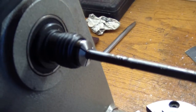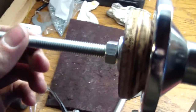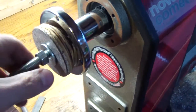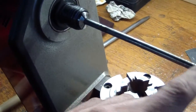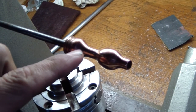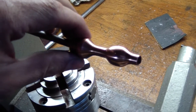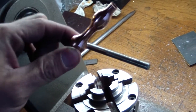What I changed here is that I got a hold of some arbors. That arbor is made for a quarter-inch rod, which is what's sticking out of this right now. It's designed for a draw bar — I just took a piece of three-eighths all-thread and stuck it through, then I have a block of wood and a nut which tightens and draws the arbor in. I'm doing that because I want to have a piece of copper tubing spun down against the rod so I can get that quarter-inch inside diameter — nice and smooth — so I can easily take a piece of quarter-inch copper tubing and braze to that to make different things.